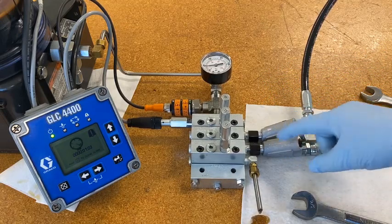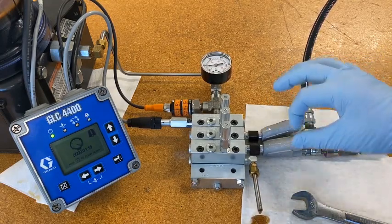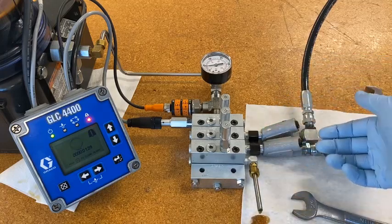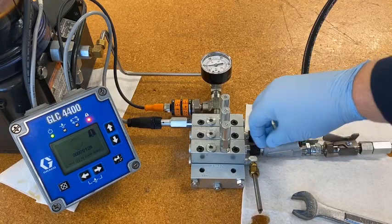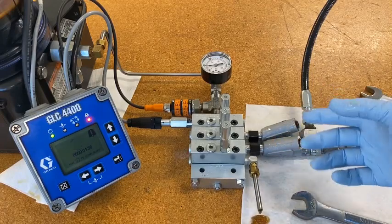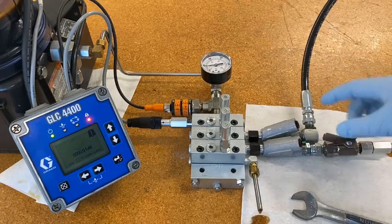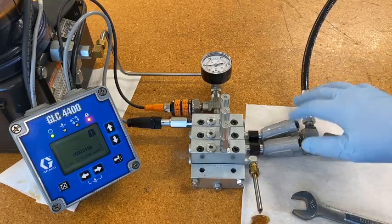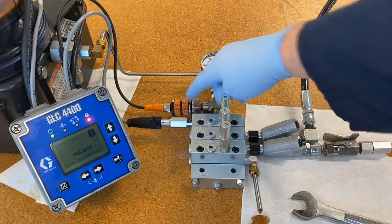The reason is that the actual porting inside of the indicator is a fairly narrow opening. When the spool drops down and seats, there's only a tiny little surface area exposed to the grease pressure, so to unseat that takes a lot more pressure than it takes to hold it out. When the spool is held out and up, it has a lot of surface area exposed — the pressure gets through that hole, spreads out, and applies all that same pressure to the larger surface area. The term 'effective surface area' is the key to how broken line indicators function. When your line breaks, it causes the pin to drop, and getting the pin to come out again causes a pressure spike that you can detect with your pressure switch.